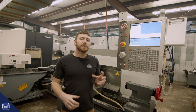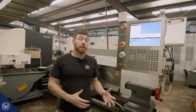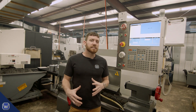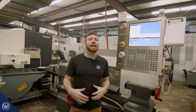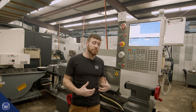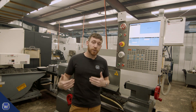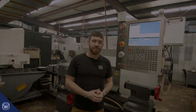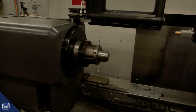Now that we've got all the on-machine automation complete, I'm going to let my guys run this for a shift or two to prove out these tasks. We can't have the machine dropping parts or chips on the tools when the robot is in place. I find it's best to troubleshoot in steps rather than build the complete cell and then try to go back and troubleshoot each individual part — it's a lot easier when the robot isn't in the way. In our next segment, we'll bring the robot in front of the machine and integrate it into the cell, as well as do the part presentation. Thanks for watching part two — make sure to check out part three where we wrap up our UR integration.